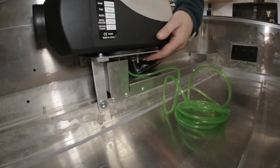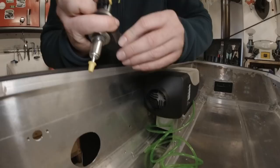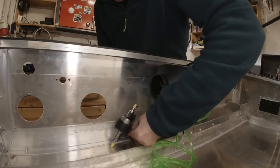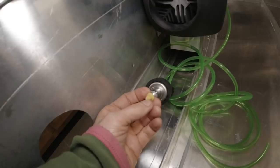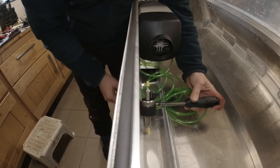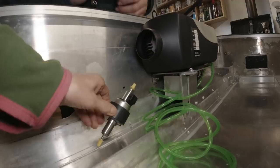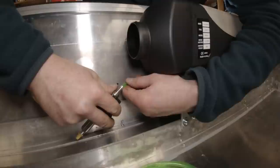That heat shield goes around our exhaust hose. Now when you look down here, everything is nicely protected. This is the fuel pump and it needs to be mounted so it's pumping upwards. The secondary fuel line behind the pump is not supposed to drop in elevation, but that's not always possible, so you make the best you can. I'm using nylock nuts here and the mounting bracket is made out of rubber to dampen the noise of the pump.